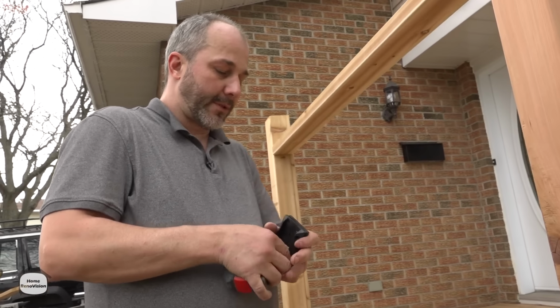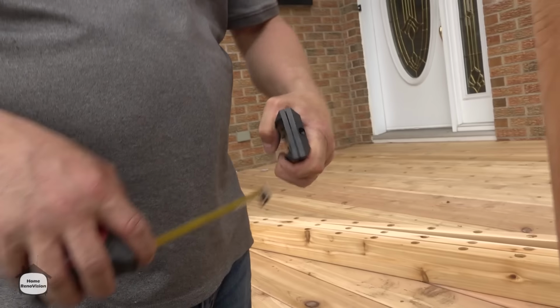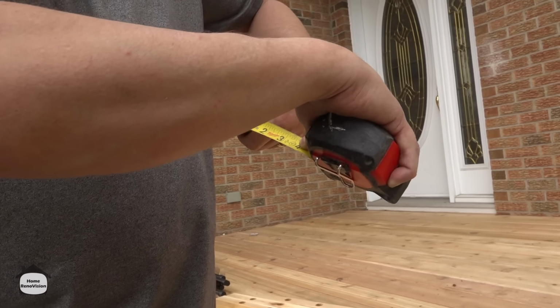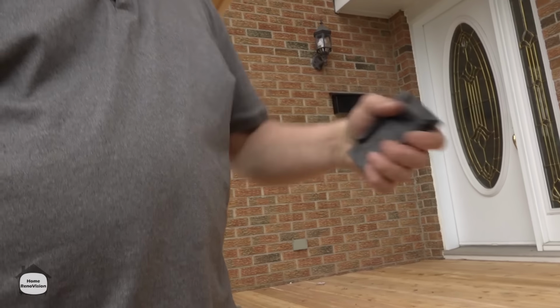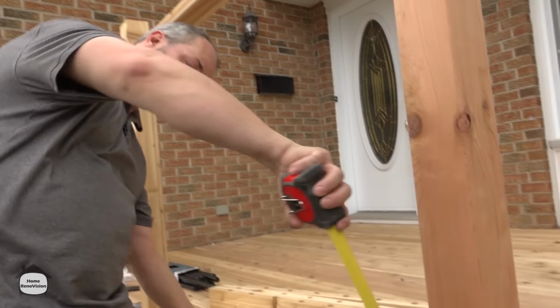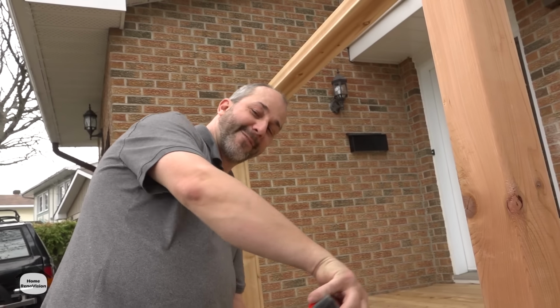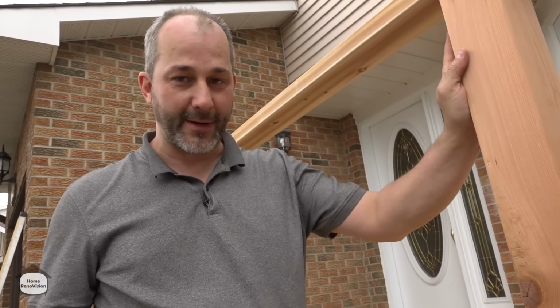And so that's cool. So what you have to do is take the 2 plates together, measure the thickness of both those plates, and it turns out to be 1/2 inch. So I got to take that off of my measurement. Remember, we were what? 49 3/8 minus half is? Yeah, 48 7/8. Good guess. So we're going to cut 2 pieces 48 7/8.